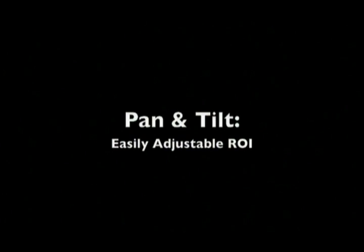The camera has a digital zoom of up to 400%, and pan and tilt, giving great mobility when creating the region of interest. With the Widmaster Pro, you have complete control over exposure and gain. Exposure time, for example, can be adjusted to fit the 50-60 cycles of background lighting coming from fluorescent light. The gain can be adjusted to give you the strength of signal you need to accurately extract the digital information from the video feed.